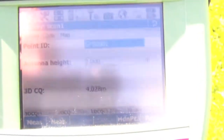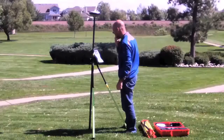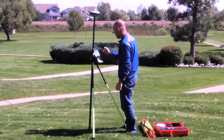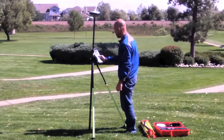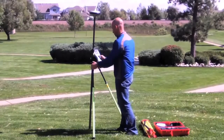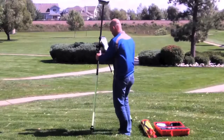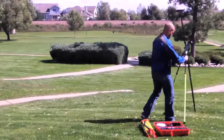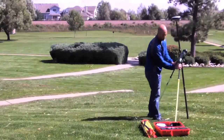We have connected everything, got our GPS up and running. We are connected to a network, receiving RTK and we have a fixed solution. Now, what do we do when we lose our GPS network? We will take a measurement on the network and set up our other GS-14 over this point as our base. We have finished and stored the point. We would now like to set a base up over this exact same location using just the other GS-14.